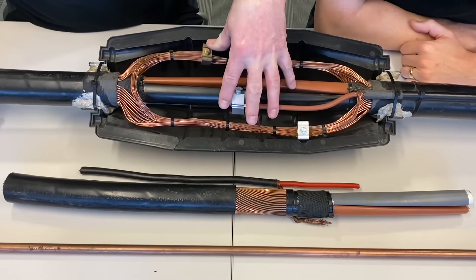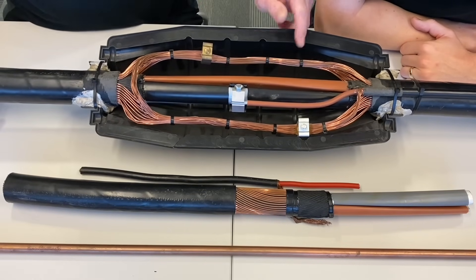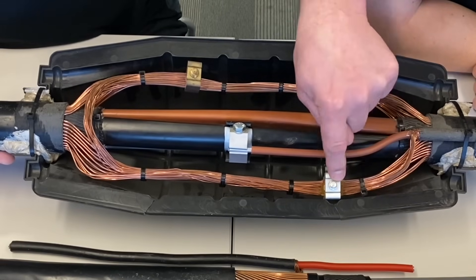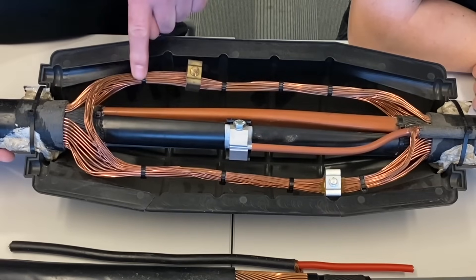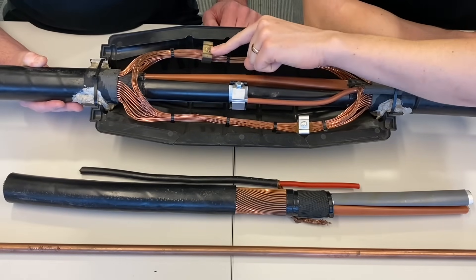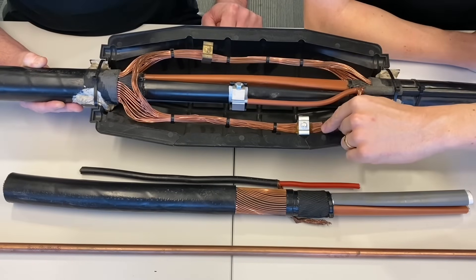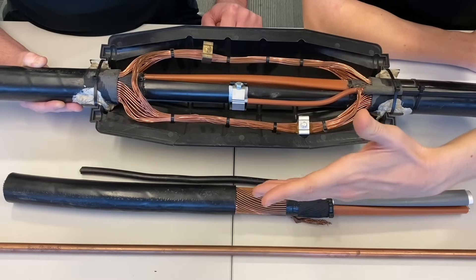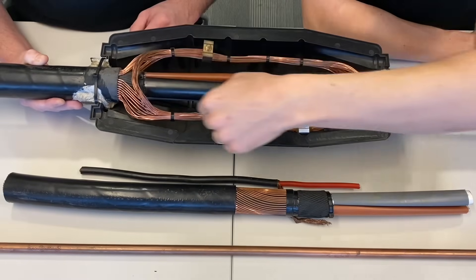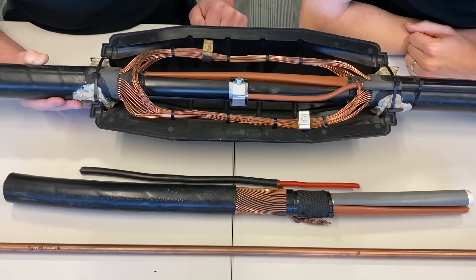It was always historically the joints that fail. When joints were failing, it was potentially the neutral and earth we were losing. By not breaking into my protective earth neutral, I can't lose it — you haven't created a weak point. The concentric cable going up to the installation was never staked; it was always just one conductor from the joint. What I also like is the way they've connected the neutral earth — it comes off, goes into a clamp, comes all the way around, and is clamped again on both sides. The bolts have no head — they're cranked to a specific tightness and the head shears off, so you always know you have the right tightness.